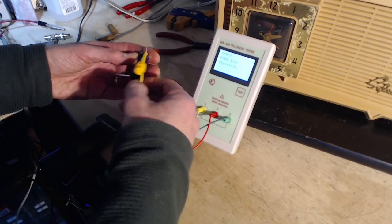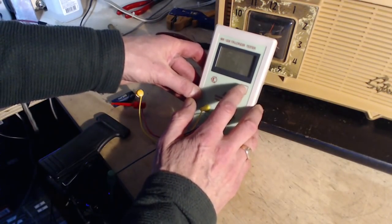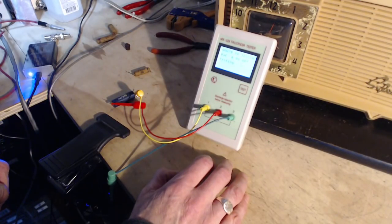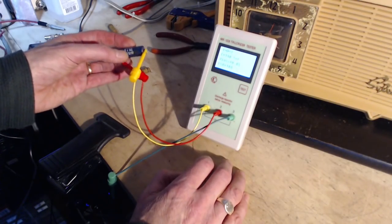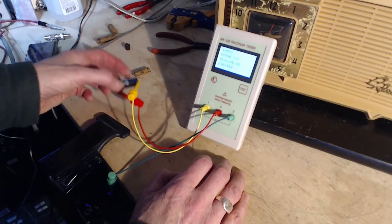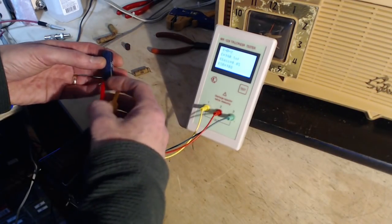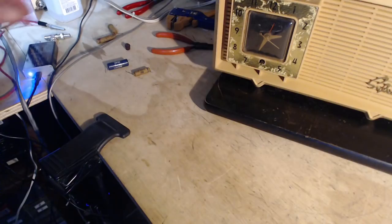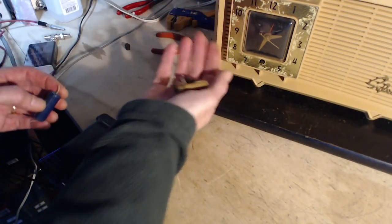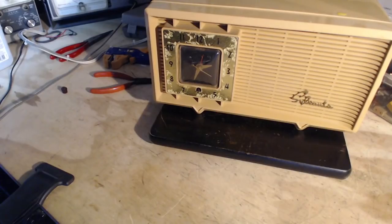So I'm much more comfortable with the old style tester because I understand what leakage is and I understand how that can mess up a radio. So this one says it's 140 nanofarads. That'd be a 0.15. It's not 0.15, of course, it's a 0.05. So the reading is way off. ESR 18 ohms. How bad off can you be changing these other than spending time and effort and a wee bit of money? Lucky none of those were charged up, or I'd be jumping.